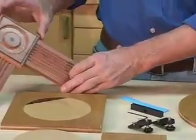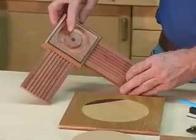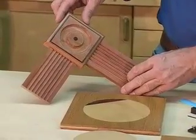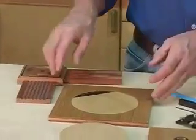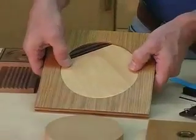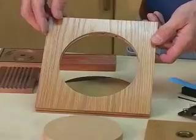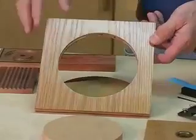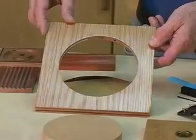Here's a plinth block that was part of a decorative casing in cherry. You'll see we covered the center pin with a little walnut block as a design element — very tricky. Here's a mock-up of a flooring inlay where the center piece is accurately matched with just enough clearance for expansion and contraction.